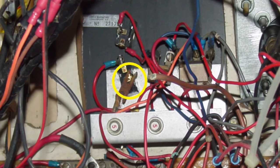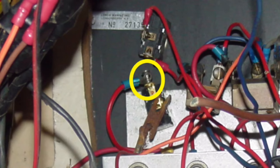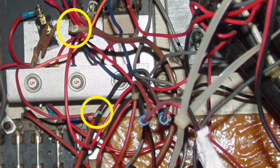First up, the venerable rusty, corroded alligator clamp. Whatever's getting its power from this thing has a slew of intermittent issues and operational problems. Or what about this loose power connection? This baby is arcing and sparking every time the boat hits a wave. And let's not forget the potential excitement that can be caused by these two exposed, energized conductors as they bounce around the boat looking for something to short.